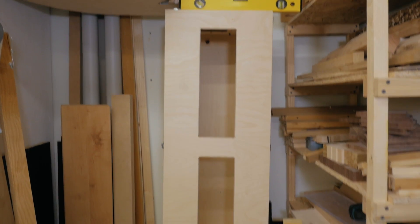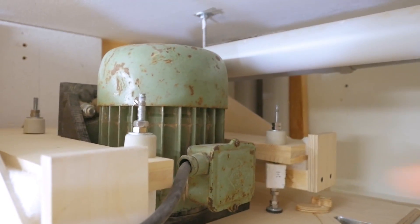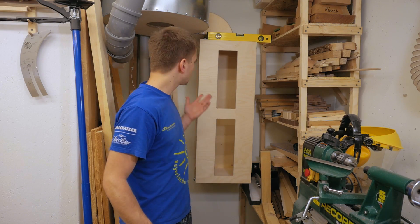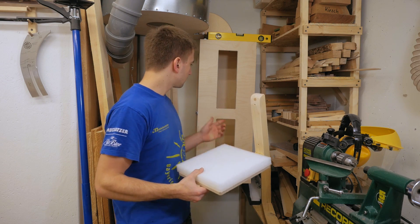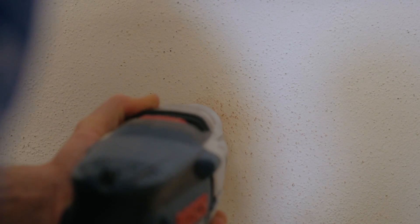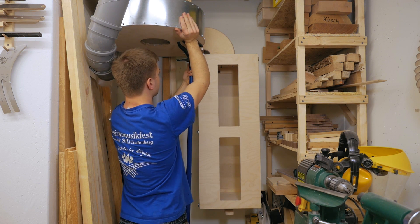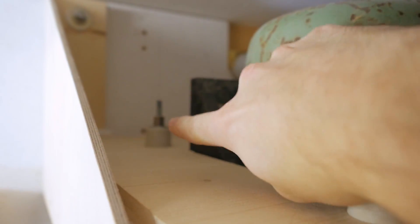Installed back on the blower, you can see it hangs crooked again, because the plywood door and filters added quite a bit of weight, and this time I can't adjust it — right now everything hangs from these two supports and the ones in the back are loose, you can see a gap there. So I really needed a better way to support this heavy filter box, and therefore I made a big angle bracket and a pad with foam on it to reduce vibration. The angle bracket is in place; I can remove the support. With this, the filter box now has its own support, everything is still free to move, and I could take the load off the front bolts so the ones in the back are doing work again like they're supposed to.